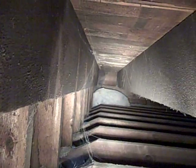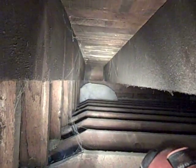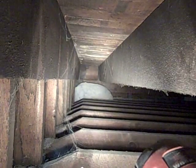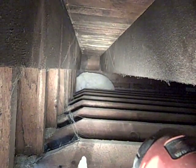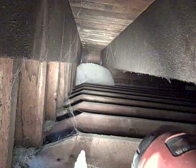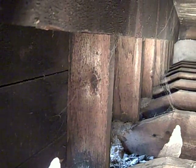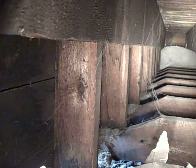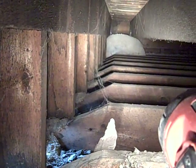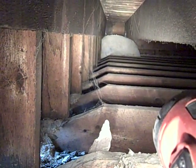The onion bag is filling up and it is about an inch or two from that top floor joist, and that's our goal. So now when these exterior wall cavities are filled, dense-pack insulation will not come down into this open space or into the floor or ceiling joist cavities.